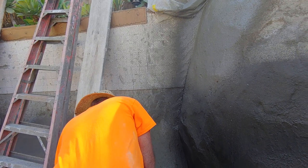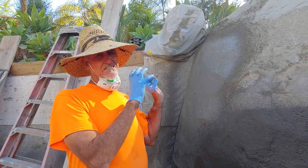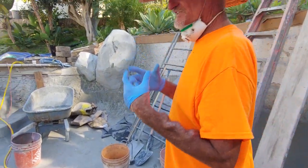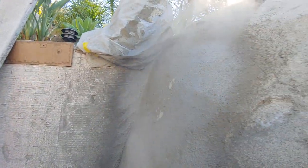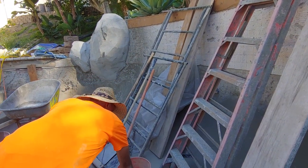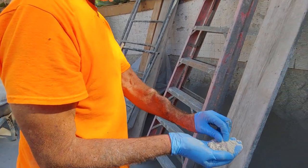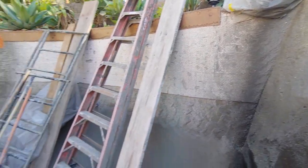That went out great — absolutely perfect mix, Daniel. So this is the Dave technique: I'm going to throw a little fog coat on here and then put the stamp on. The fog coats are a cementitious product and we've got a little bit of the gray-green color. You just want to apply it kind of randomly — I have a video on that on my channel. It's okay if there are little chunks; you want some irregularity in what you're putting on here. This lighter color is awesome — we're putting on the fog coat, which is a stucco product.